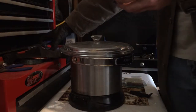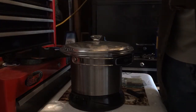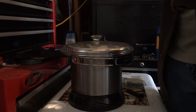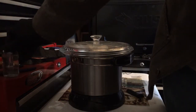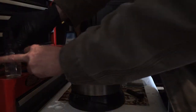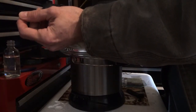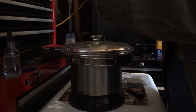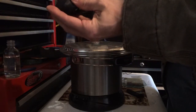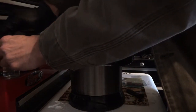Let me cut the piece of filament for the size I need. Anything with a hole I try to fill with the same color filament before I do this. So we have our filament cut to about a half inch. I have a glass eyedropper here with acetone — put just one drop down that hole and that will hold this filament in place, pretty much glue it in. Push it the rest of the way in and put a little drop on top to seal it. Give that a second to dry.